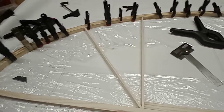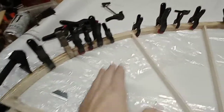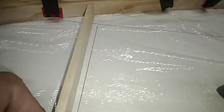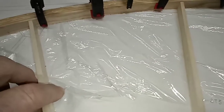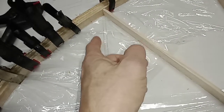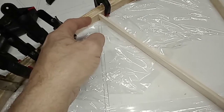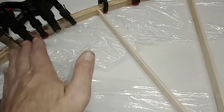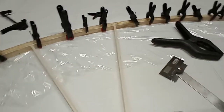Not only that, but all these gussets, all this blocking — every single corner needs this blocking. That's a lot of work because they have to fit tight. Notice this one doesn't run right along that line, but that's going to be just fine. This one here will fit almost perfectly in place. I've got to cut these, then dry fit the blocking so it's snug in every single corner, and then I can glue it all together — that'll involve some more creative clamping.